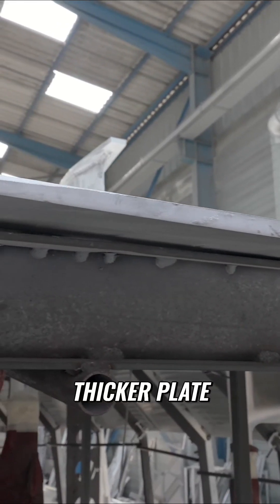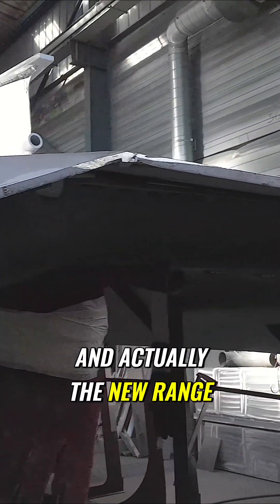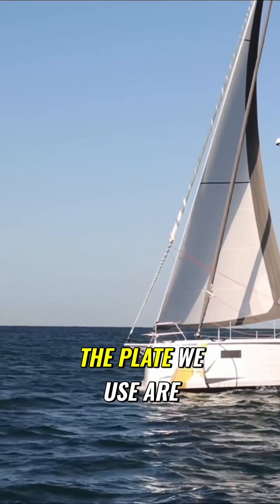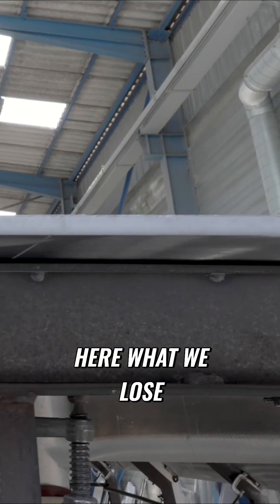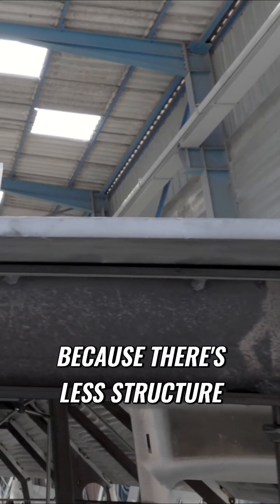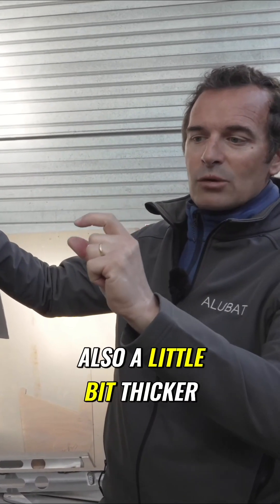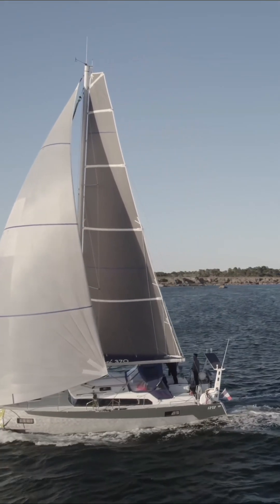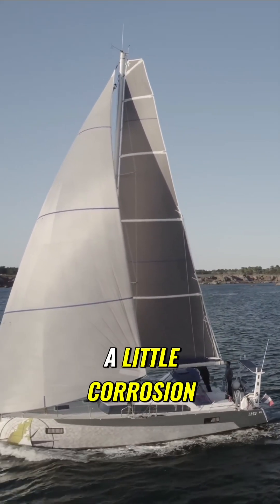All the new range went to thicker plate — that is 10mm, whereas the old would be 8mm. The new range — 370, 430, and 490 — uses plates that are thicker than the old version. What we lose in structural weight because there's less structure, we gain in plate weight because the plates are heavier. They're also thicker, so that's more resistance impact-wise, and it's also more reliable if you have at some points a little corrosion here and there.